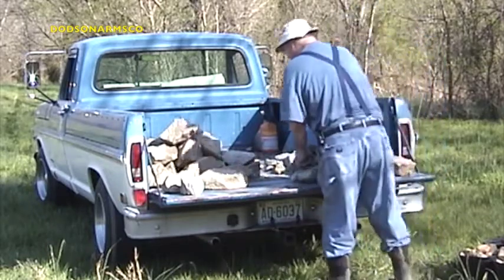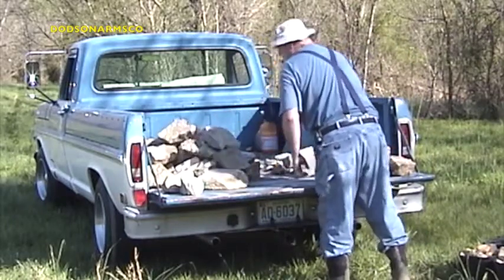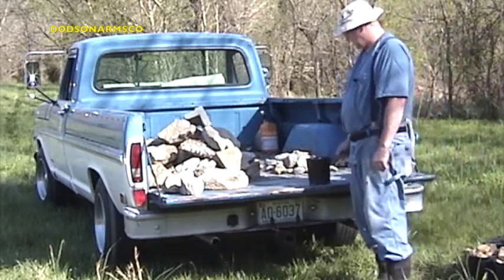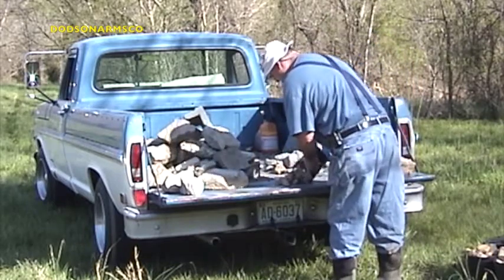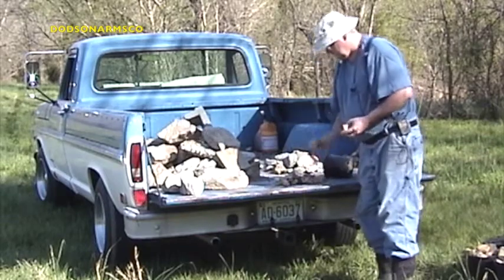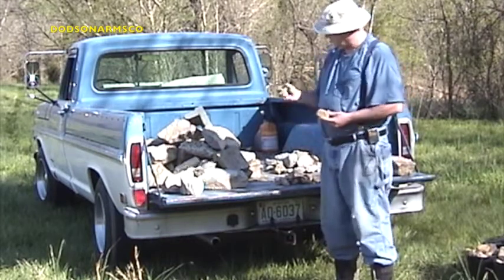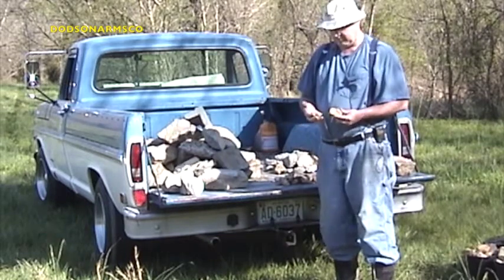The last size of material we're going to look at is stuff that's roughly the size of 57 stone. 57 stone runs from one half inch up to one and three quarters inches. This small field stone will be the final layer on top of the number two riprap, then number one riprap, and then stuff that's roughly 57 stone size.